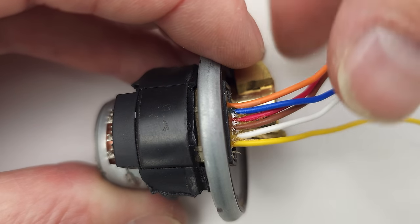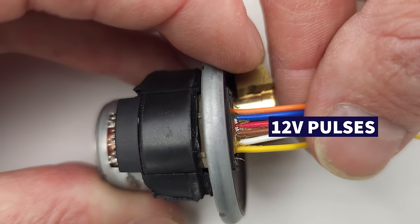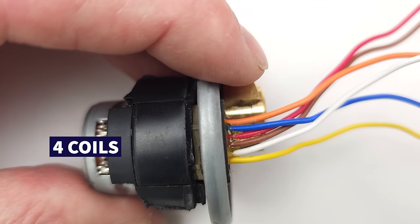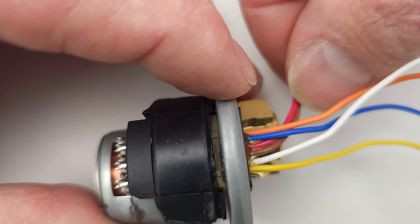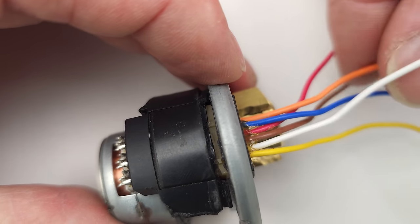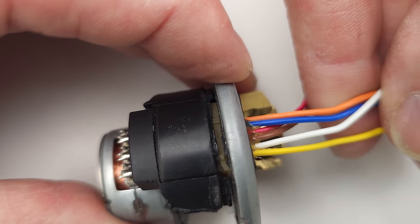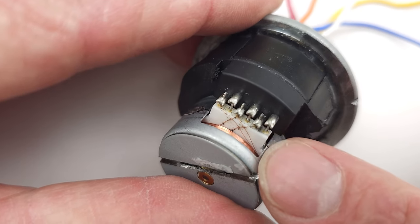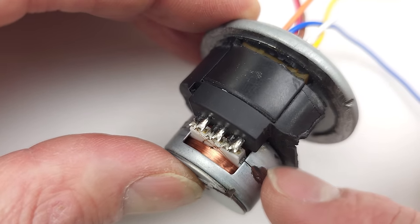To fully open or fully close this, it's going to take a massive amount of 12-volt pulses in sequence on four coils up here. Two of these wires are commons, and they lead over to the sets of coils. Then the other four have to be powered in a certain sequence. There are actually two sets of coils at the top and another two down here.